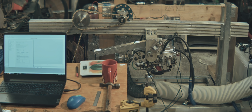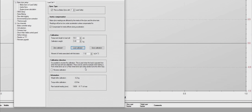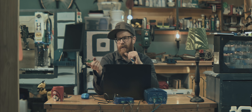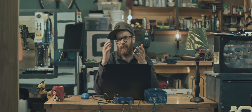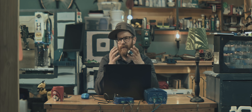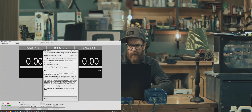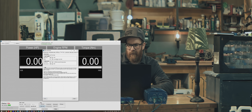Now if I remove that load, we should read about zero again — and we're reading about zero. Order of operations: start the engine, let it warm up, check what kind of RPM range it's working within, enter a suitable sweep range into the software, and do a little power sweep just to see where things are at. Here's my minimalist setup for now: engine RPM, horsepower, torque, and brake percentage. We'll plug in the RPM range and try that sweep, see what happens.